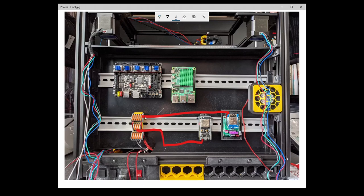We've got the Pi here. What I'll also do is, from the 5V line — because I've got one — come up and power my Pi directly from the GPIO pins, same for ground. Some people will tell you you're not going to get the protection there that you would going via USB. But on the Pi 4 it makes no difference — you haven't got the protection either way from what I understand. So you could knacker it if you do it wrong. Double check it.